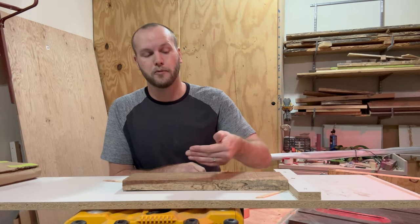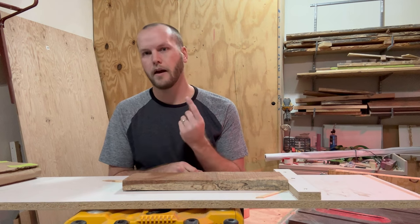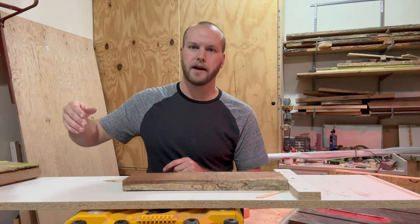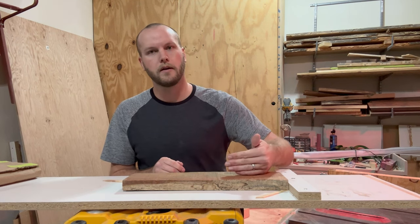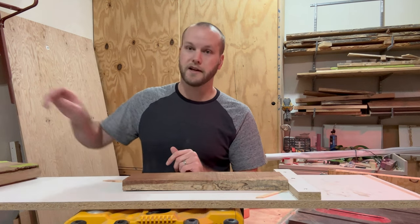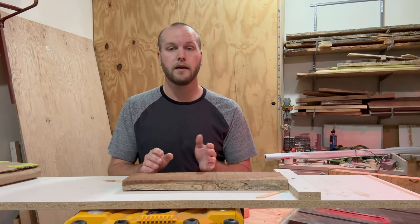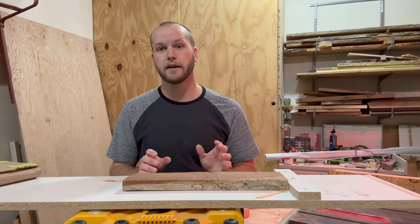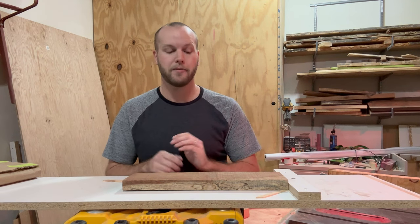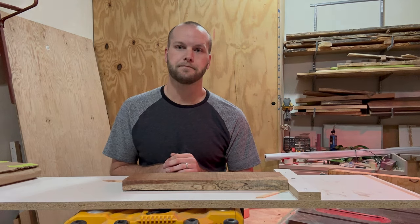With that in mind — given we're in that territory of just making it work because we don't have a jointer — a few things to keep in mind: wear hearing protection and eye protection. Don't stand directly behind the planer bed. No matter what I've said in this video, always assume the board can shoot out like a bullet. Don't put yourself in the line of fire, and don't put anything you wouldn't want destroyed there either. Always assume with these big machines that kickback will happen — that's how you stay safe with a thickness planer and a flattening jig.